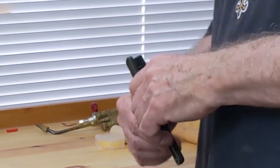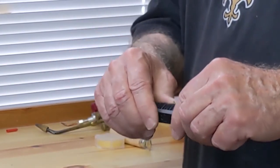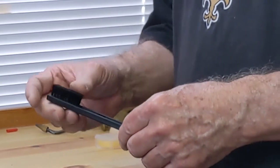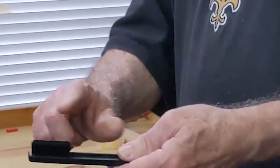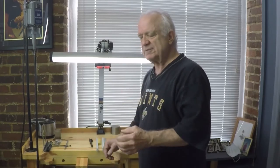After you've pickled your piece and cleaned it up and polished it and everything, you need some kind of a washout brush. Use ammonia, soapy water, and hot water, and use this old plastic brush right here. A toothbrush works just as well. I used to make the mistake of using my toothbrush, and then I'd brush my teeth with it, and it really tasted weird, you know? And I figured, what am I doing? I said, oh, I'm eating flux, so I don't do that anymore.